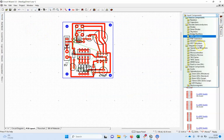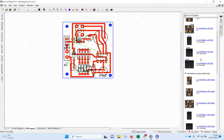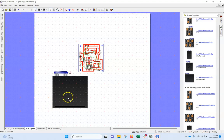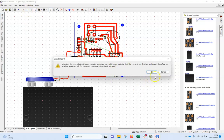Let's see if this works. I'm going to go to the gallery, down past the green components into the red components, and I need a power supply. I'll try the six-volt option — it says it's made of double-A batteries, so four batteries at one and a half volts each. I'll put the power in there and ground in there. The LEDs are on board — I don't think I need anything else. Let's push the play button and see what happens. Accept the warning and go to the real-world view.